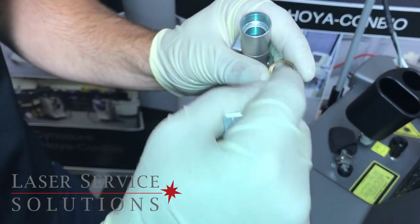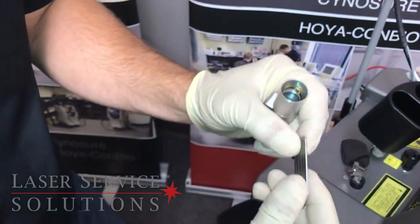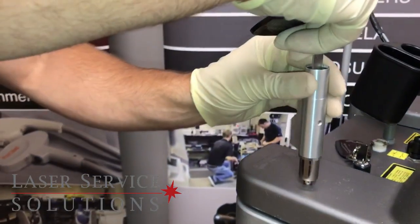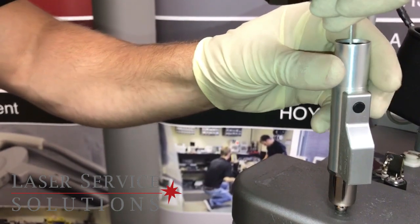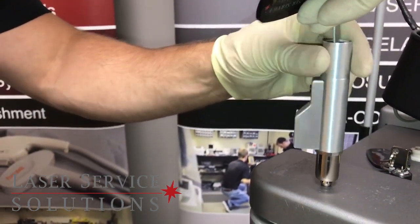Take the brass ring with the little grooves facing up and drop that down in there. Take the tool back down into the grooves. What I do is go in reverse — as if I'm unscrewing it — until it clicks. That way you don't cross-thread it while you install it. Then tighten it.